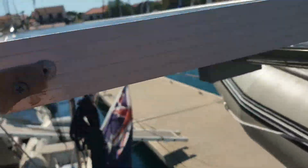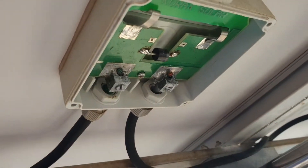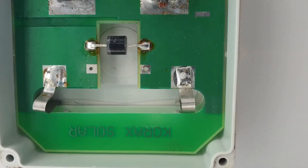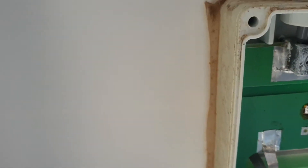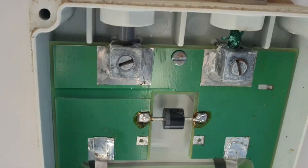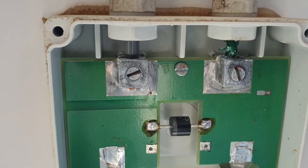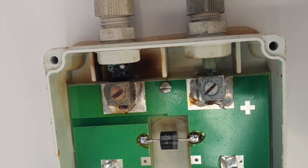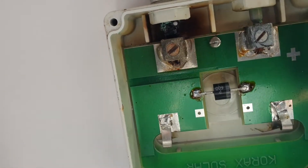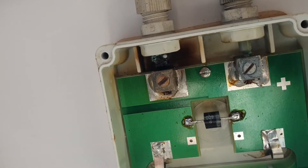We have two solar panels and underneath we have the connections for the cables. One possible cause of having open circuit voltage but no short circuit current is poor or damaged connections on the cables going to the panels, so let's have a look. The first connection looks pretty good — nice and clean, nice and tight. The third one has green corrosion, so that's possibly a very poor connection. On this connection box, one connection looks good and the other not only looks corroded but it also looks like it's overheated. I can see some brown charring in the back of the box. So there we have it — a possible problem.